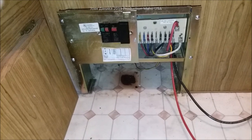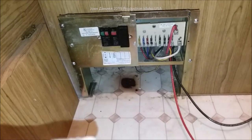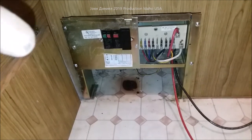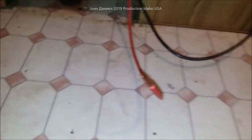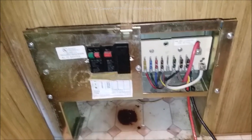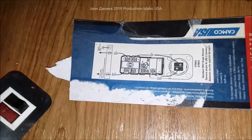We're going to put a regulated power supply — they're only about 23 to 24 dollars, 30 amps — in here. Then for the battery system, we're going to put a standard automatic 8-amp battery charger. By the time I'm done I'm going to spend 50 bucks, or I could buy this whole converter for almost $200. I'm going to have smoother power — no hum, no buzz, nothing. I've added all new six-gauge wire here to hook up to that system and run my 12-volt again, because right now my 12-volt is off since that fire hazard was removed.